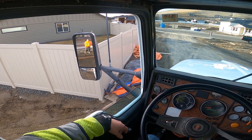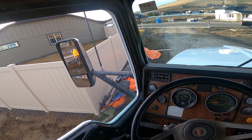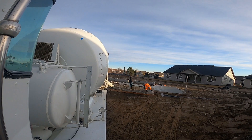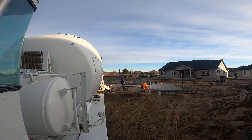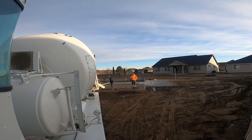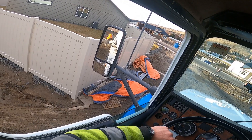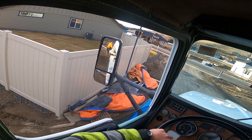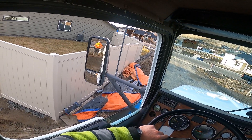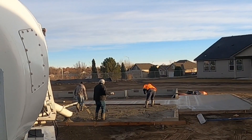Sometimes these guys are in a hurry — I didn't have time to set up the camera. I got out and we looked at the concrete, and he wanted me to add 10 gallons. Usually it's one gallon per yard to bring you up one slump, so if you have 10 yards and you're at a five-inch slump, add 10 gallons and you'll be at about a six. I put three chutes on — that extends my reach about 12 feet.